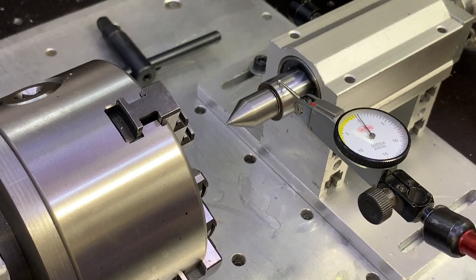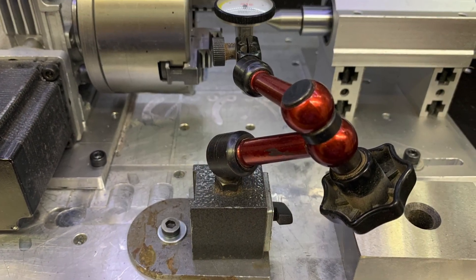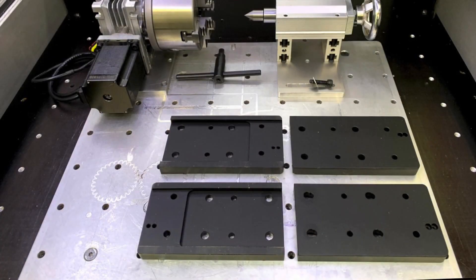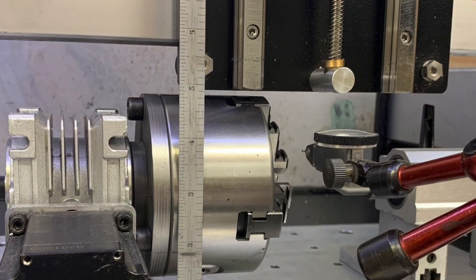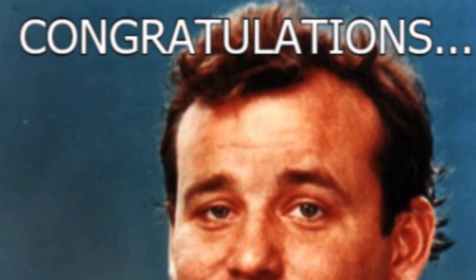If you add a four-inch rotary table to your system, your system only has three and a half inches of height — there's a half inch interference. Just showing you a picture of some of the tools on how I measure my system. What I did was hand-file a notch in that gearbox to allow easy access to get those bolts out, since I change between a chuck and a four-jaw. These are the riser blocks that I've made — it gives me about four inches, nine hundred thousandths clearance, about an eighth inch over the chuck, which I rarely use, but still is the adapter plate on the left that I need to clear. And that's it — that's everything that we've done. Look at all the documents, read things over. This is a fairly simple set of modifications, but they're robust and you'll be really happy with the end result. You end up with a $2,000 plus rotary table. Thanks for watching, have a great day.